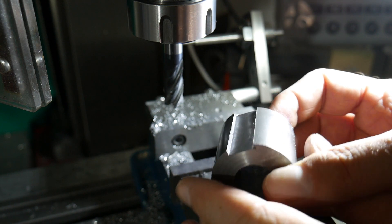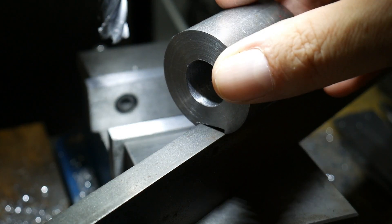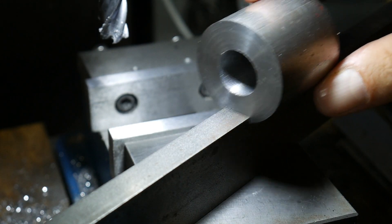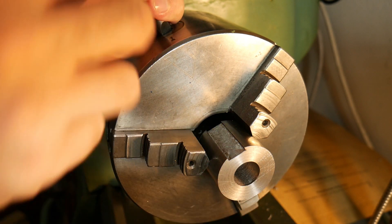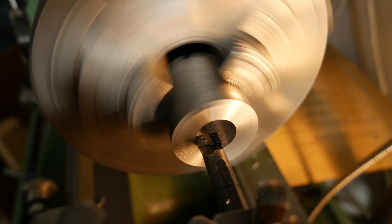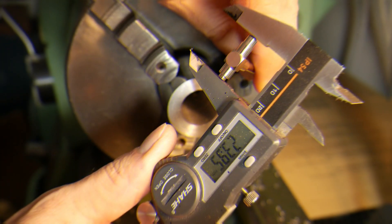The flat bar will be welded along the edge that I indicated with my finger. I make a small test to see if the depth of the groove is enough for the flat bar. I return to the chuck with the round bar and I finish the internal hole to a dimension of 24mm. I check the internal diameter with my special caliper and the diameter has to be really 24mm.